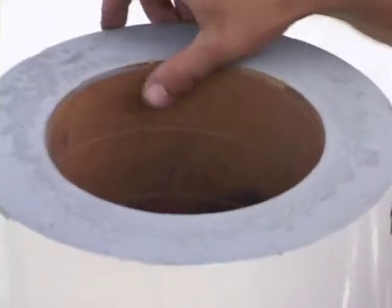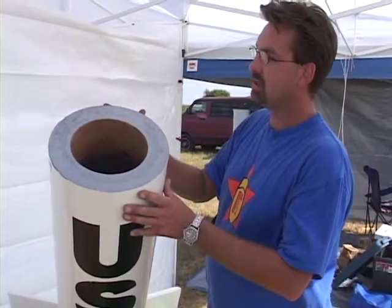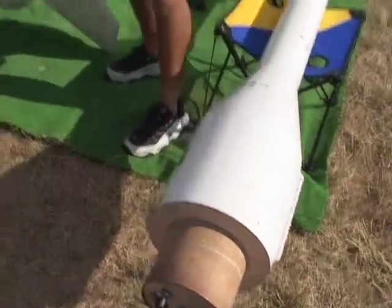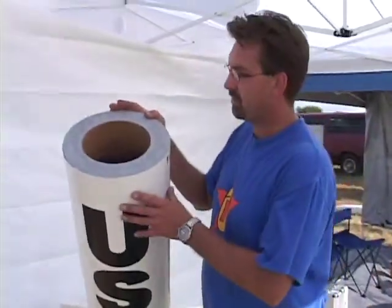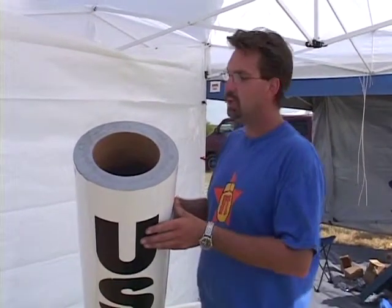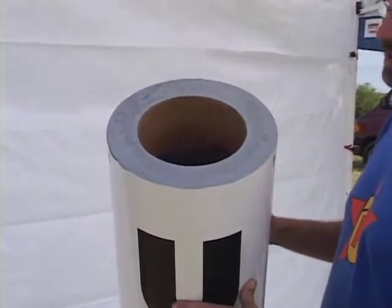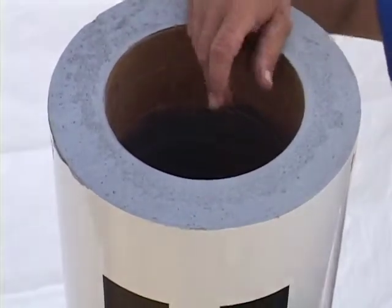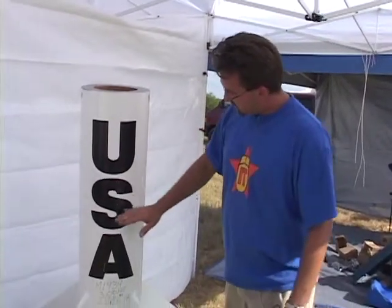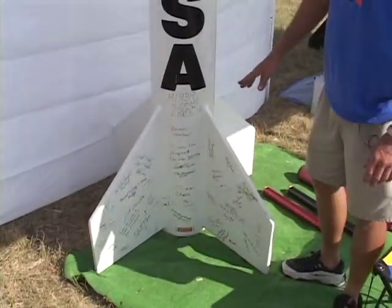The inside of the booster section is made from a 7½-inch diameter body tube. Going from 12 inches, necking down and then coming back up, I wanted to have a little bit more structure than just trying to figure out how to join a 12-inch tube. So there are centering rings inside throughout the entire body. The top section just slides in with a normal coupler. There's a centering ring about every 6 inches throughout the entire rocket, until you get to the fins, where there's one every 4 inches.